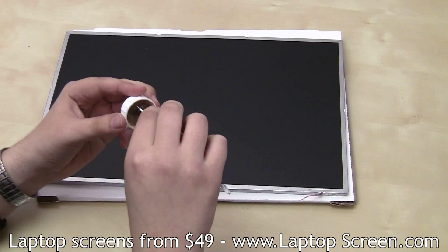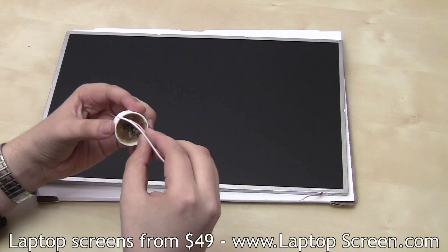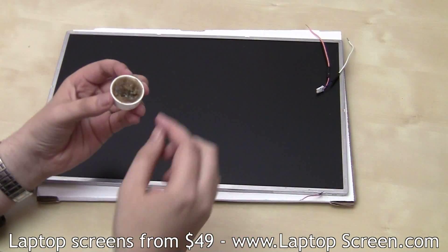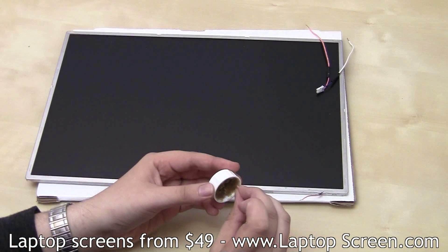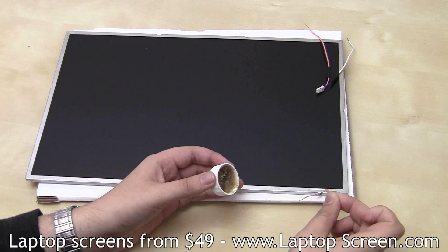For the second pair of connections, I'm dipping both wires into acid flux, which is almost a magical type of substance that can be bought at electronic shops or plumbing and hardware stores. It significantly improves soldering and makes the solder stick to metal much easier. I'm also spreading some acid flux on the inverter leads.